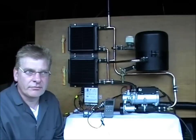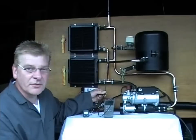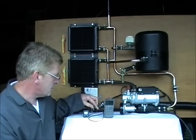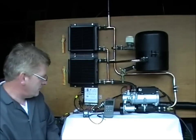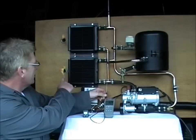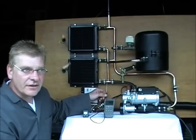Okay, the glow plug is now switched off, the heater's fully ignited. Maybe I have to set this temperature. We're now up to run about 3 radiators plus hot water. As you can see now, the temperature should have reached around 50 degrees, and it's actually put these 2 little fans on the back of these heat exchangers. Okay, our heat now is over 50 degrees.